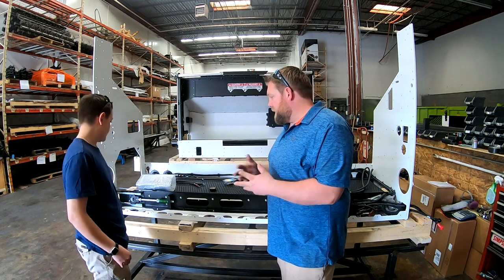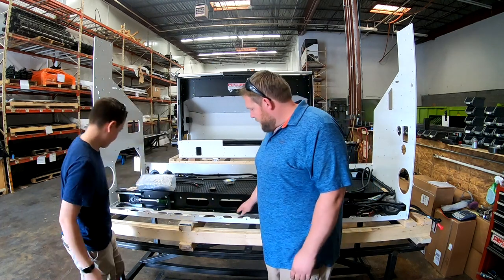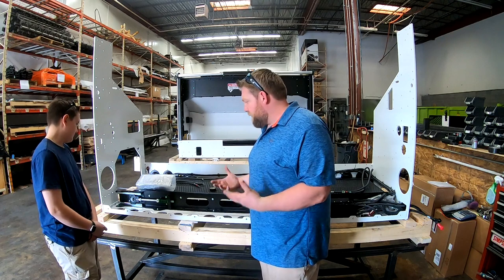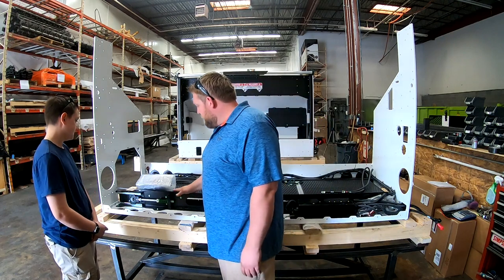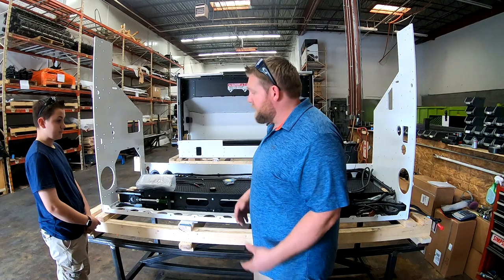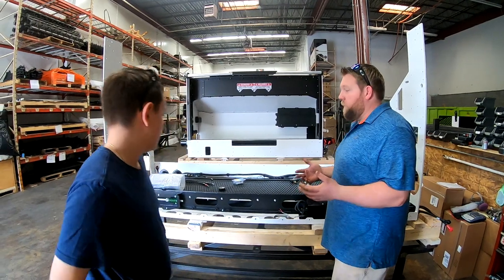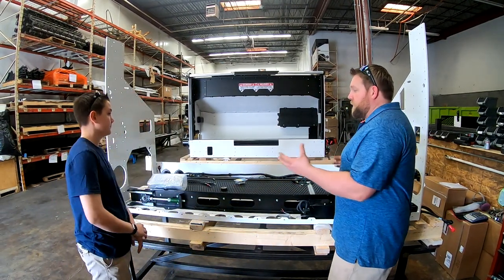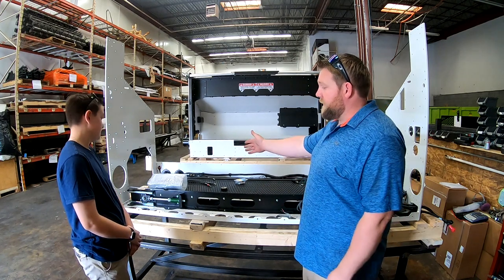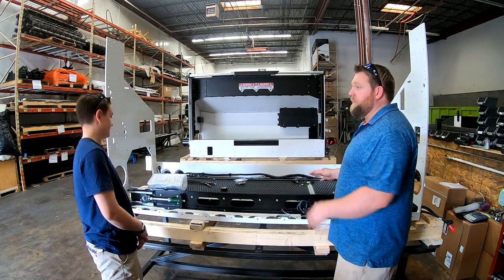At this point, what we got here is the conveyor system. It gets bolted directly to the belly pan of the machine. This black section actually acts as the core of the machine — it's got all the strength in it, it's actually thicker material. We integrated a fully adjustable self-tensioning system with these springs here. You have about two inches of self-adjusting spring action. As that belt grows over time, what's going to happen is your belt would get loose and then it would spin and not have traction. With those springs on both sides of the system, as that belt grows, it will continue to catch it. Once it reaches its max, it's time to replace the belt.